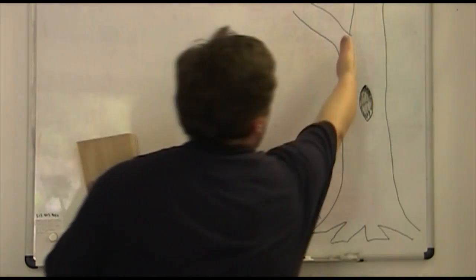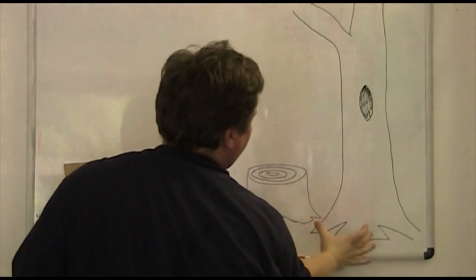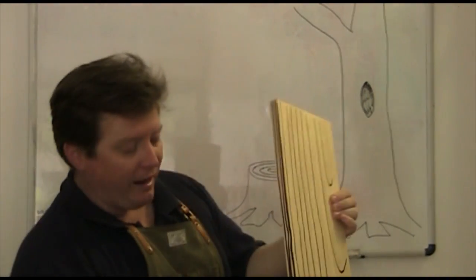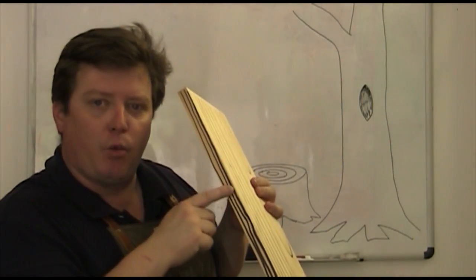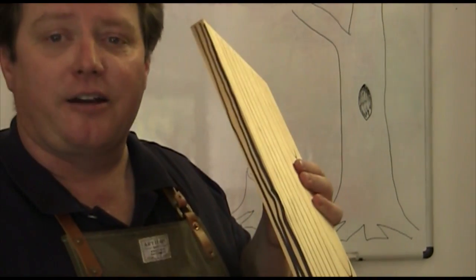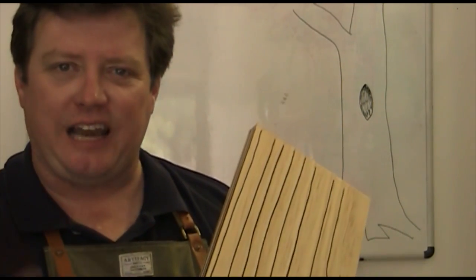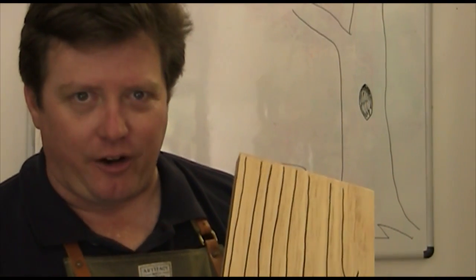When they took it out, they couldn't get a straight board coming all the way down. They kind of got it toward the center, so it kind of tapered in here, meaning the grain direction coming through the board is not straight. You'll notice sometimes you get a little waving in the grain direction. Maybe there was a tree branch that started and got knocked off, so there's a little wave in there. We don't really know, but the key thing is grain direction is not consistent in wood. So it's something we have to master its understanding so that we can get smooth surfaces. We can get straight boards. We have to deal with wood's peculiarities.